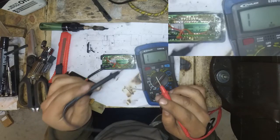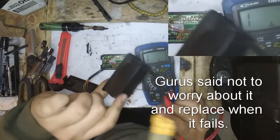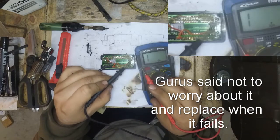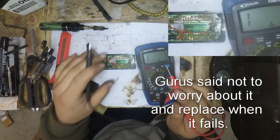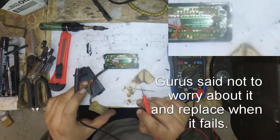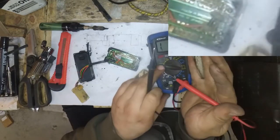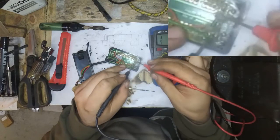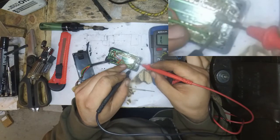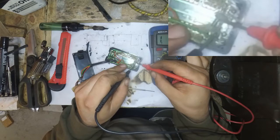However, we have this other resistor. I have a spare clock from my other car and I have opened this just to find out what the hell this is — because you can't read what it is. And this is supposed to be a 100k resistor. So if I set my multimeter to 20 million, I should be able to read 100k here, assuming that the resistor is working. But I can't read anything.